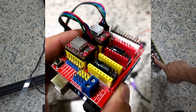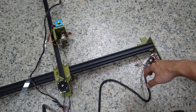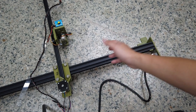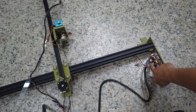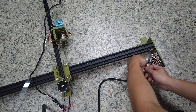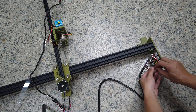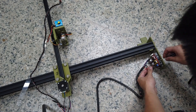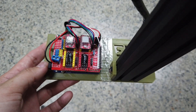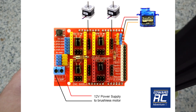I'll put a screenshot of the connection layout here. Regarding connector polarity, it could be different on yours — if the motor isn't moving or the direction is reversed, simply reverse the connection. If it's vibrating when powered, you need to swap wires among the four wires in each connector to find your pairs — you can Google about that. Then plug in the power supply wires for the brushless motor, making sure you have the correct polarity. I'll reference the instruction photos for the clear connection overview.